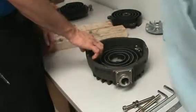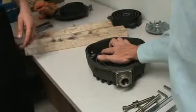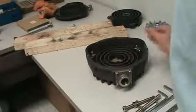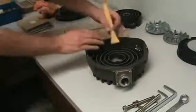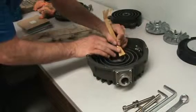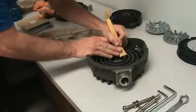It's okay to leave a little bit of gap right there. That's what I was asking about. My understanding is you should leave a little gap. Yeah, because it's easier to get it in and out. And it's still low enough pressure right there that it's not going to affect your vacuum. Just take a little plastic tool like this, and press that tip seal down into the teeth.